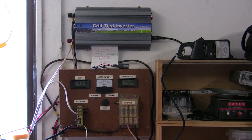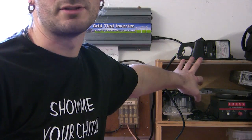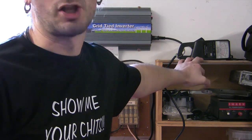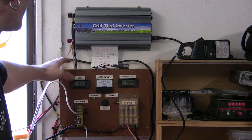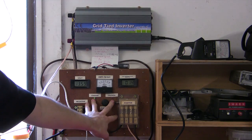So this is my solar panel, charge controller panel, and grid tie inverter — a cheap Chinese grid tie inverter. I haven't got a watt meter yet, it's in the mail, so I've cut the dodgy lead they supply and put on a cheap clamp-on meter, which doesn't really measure low enough. What we've got in the box is a kit from a website called Oakley Electronics. It's actually designed for a wind generator — it doesn't regulate the voltage per se, it just prevents your batteries from over-voltage.